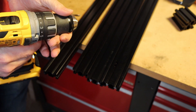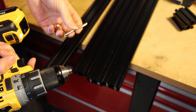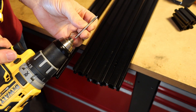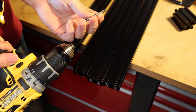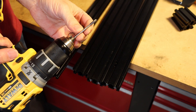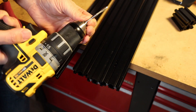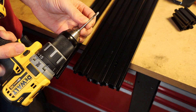The clutch is not really necessary because of the way I'm going to put the tap into the drill. When you put this into the drill you're not going to locate on the corners — that's for your actual tap handle when tapping by hand. If I put it here the tap is going to be sticking out longer, but on a tap handle there's normally some play. In this case there will be no play.